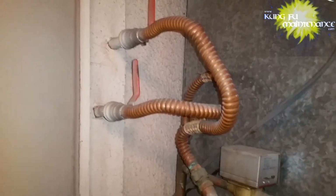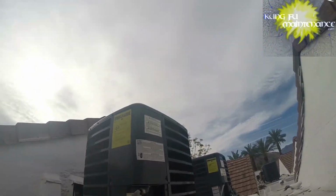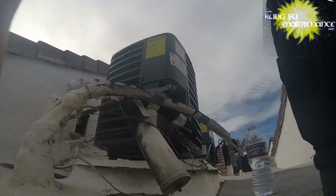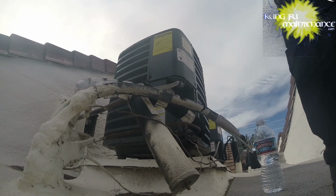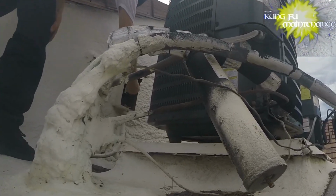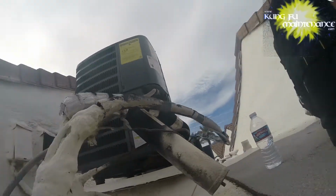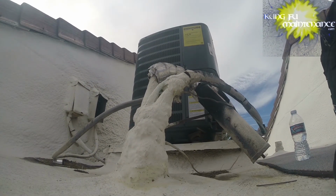Alright. Just the heater valves. Nice and cold. Good there. Okay, got away easy on this one. It was just the heater valves. I have two other air conditioners down, but while I'm here, I just want to have a good summer, and I'm going to go ahead and check the capacitors here, just stay ahead of things, so pull the disconnect. And yeah, it was weird. I knew it was getting cold, but it was just the hydronic valve, so no big deal.